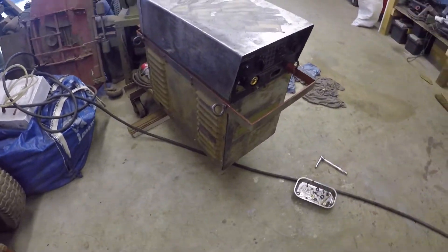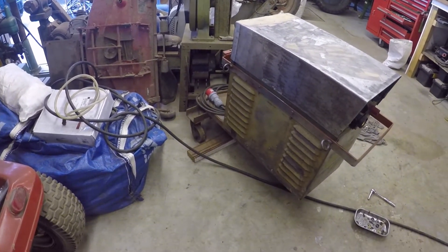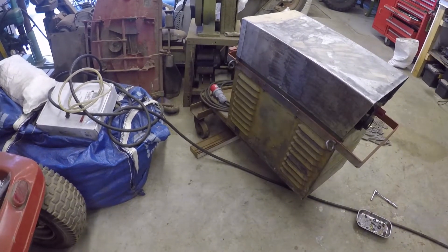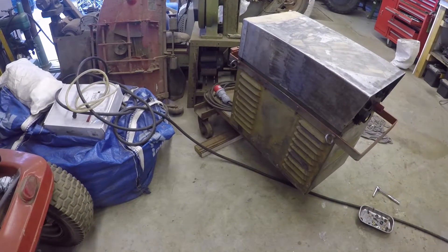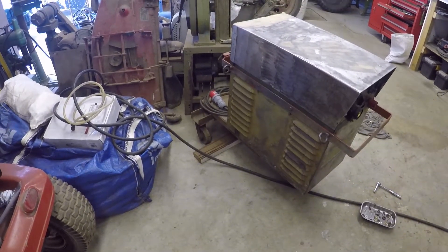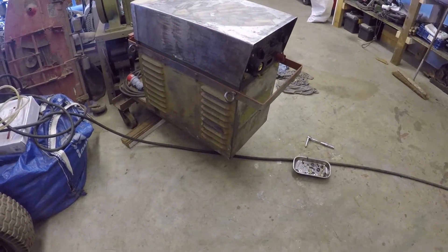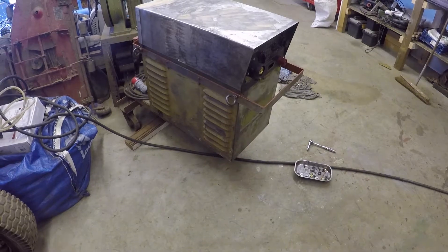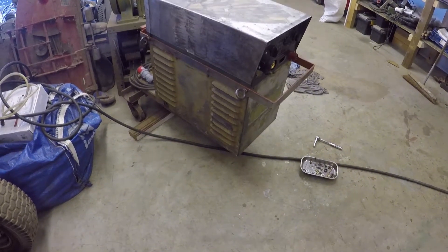I need to put another cable on it. I've noticed that the cable I left on it is good at the ends but it's actually perished in the middle — the outer sheath is perished in the middle — and you don't want that on three phase. So I'll put a new cable on it as well. But there we are, ready to turn it over, do the underside, tip it back onto its new casters and paint it.